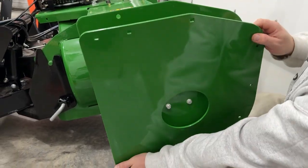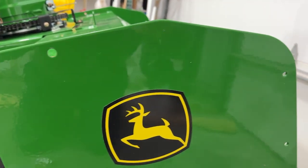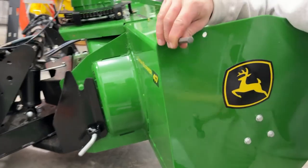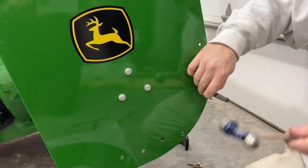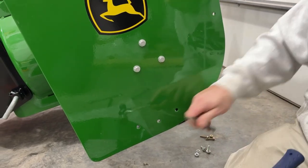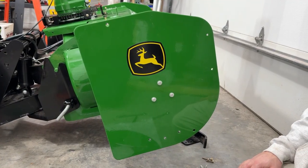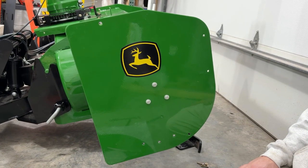The plate is going to come off and you can see we got our punch marks. We're going to go in now and give them one more whack with just a regular punch to really make sure they're marked good. Then we're going to make the first pass with a 3/16th drill bit just to get everything started so the drill bit follows those punch marks really nicely and we can ensure nice, true, centered holes.